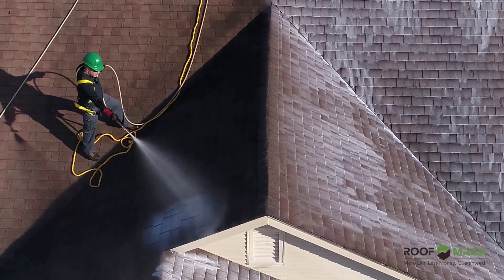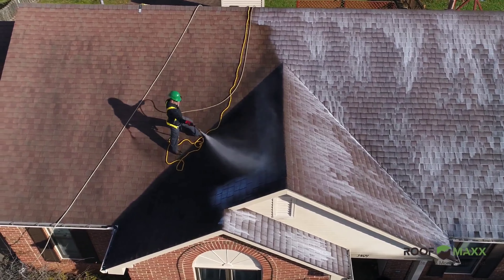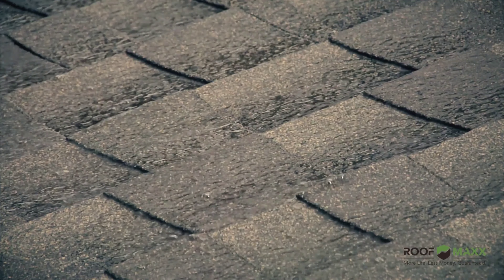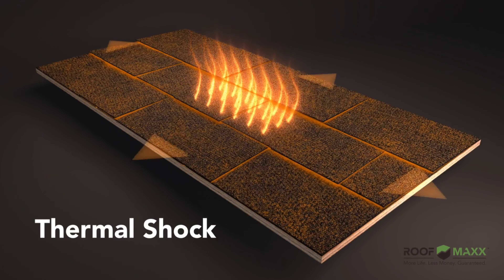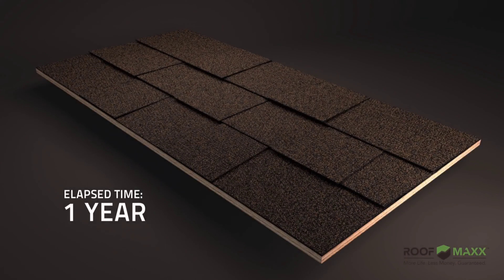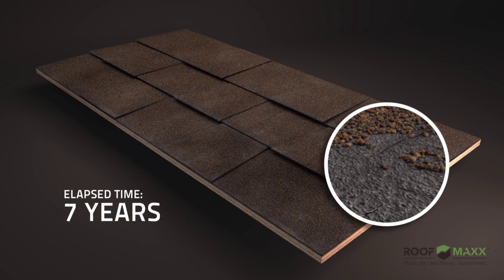There is never a good day on your roof. Temperatures can climb to over 140 degrees, causing the roof to expand. Passing rain showers quickly cool the roof, creating rapid contraction known as thermal shock. Your asphalt roof must remain flexible to withstand these extreme stresses. Oil within the asphalt allows for this flexibility. Depending on region, a roof begins breaking down between seven and ten years of age because the oil begins drying out of the asphalt, causing the roof to become increasingly brittle over time.